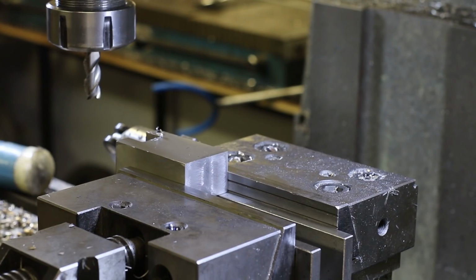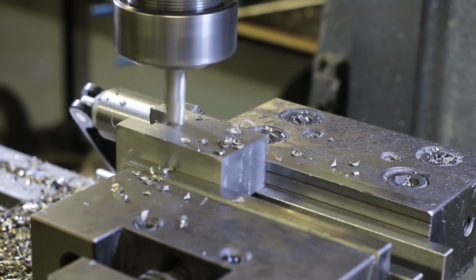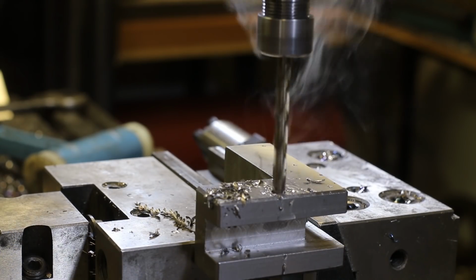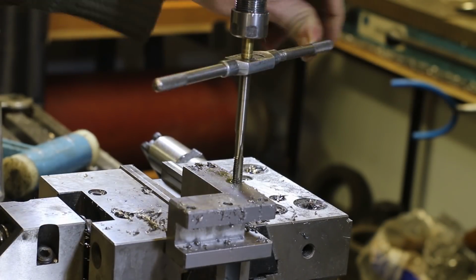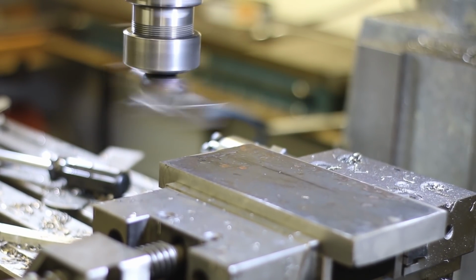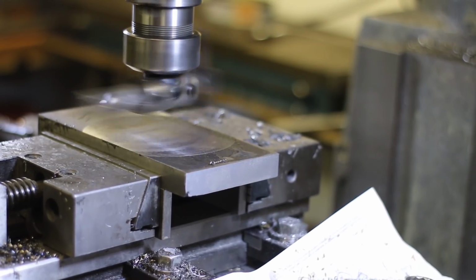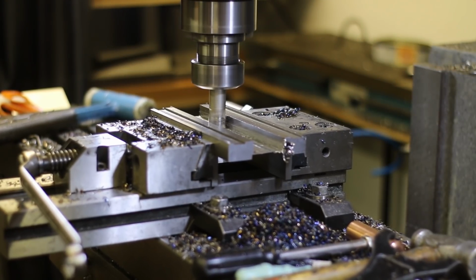The slots for tool shanks were machined to both sides of the tool post. I didn't feel like power snapping my tap, so I used a simple tapping guide here. The slide plate was first skimmed with my DIY fly cutter. Then the roughing cuts were made.